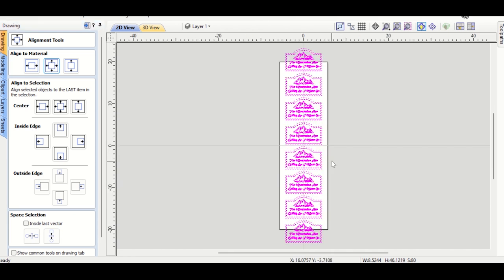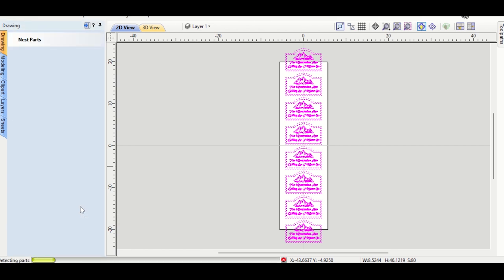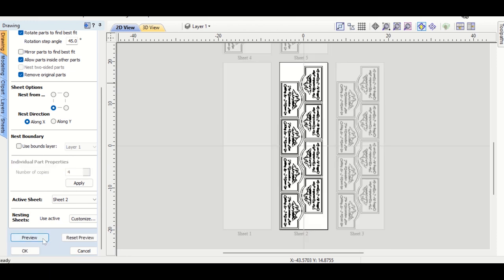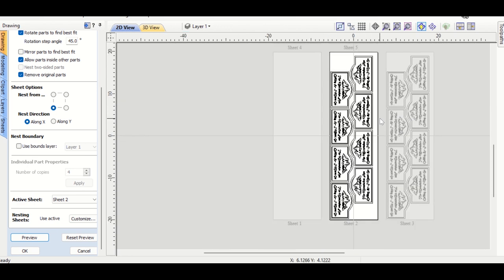You'll notice it's not going to fit on the material, but there's a really cool feature in VCarve called nesting mode. I hit Ctrl A to highlight everything and click on nesting — this just maximizes my material. Keep the automatic default settings. I've switched to a 1/8" end mill, so when I cut the profile I'll use that 1/8" end mill with clearance set. Rather than specifying a number of copies, I just preview to see if everything fits, and it has rotated every piece to fit on the material. I can fit one more — probably eight instead of seven — I just need to be mindful of clamping.